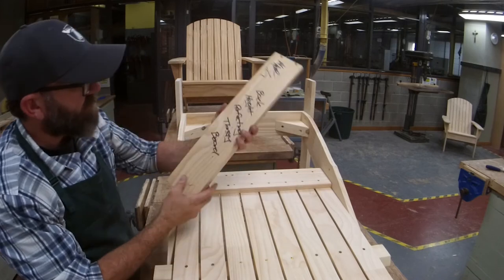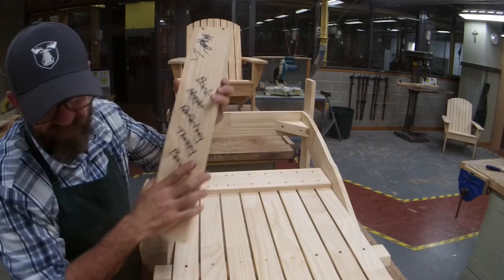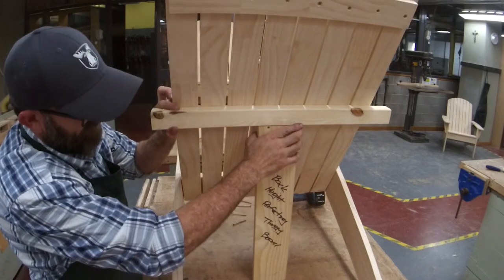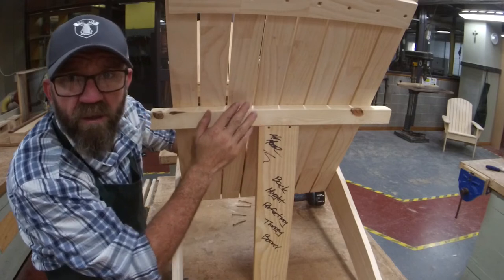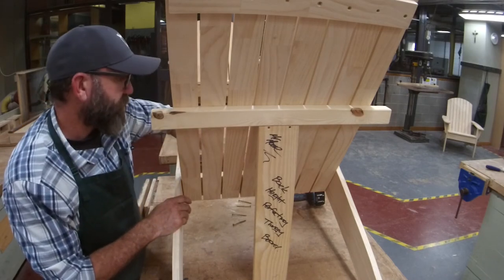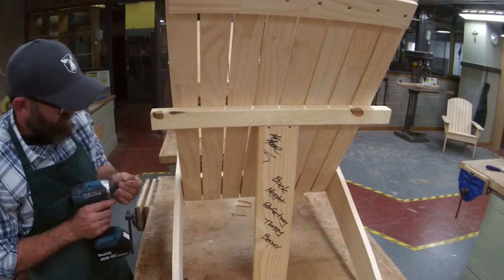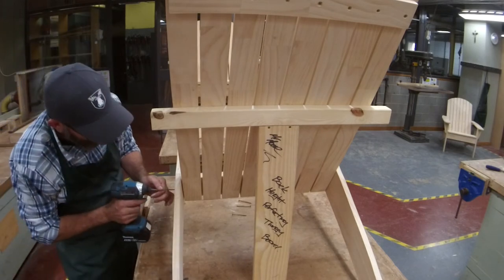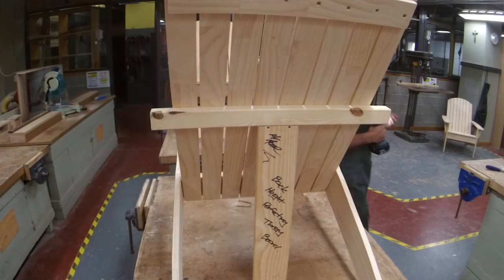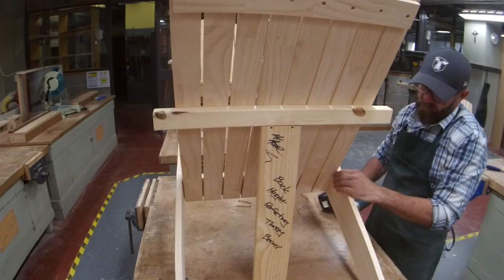For the next two holes, the next two screws, I've got this most important back height perfecting thingy board. And this is brilliant, especially if you're by yourself. I use it to prop up where the backrest should go. So now I can put the screws in, and you'll check where your pilot holes are, that they do hit that center support section that we're after. Make sure it does. I normally go one this side, one that side, so we'll finish it off. Good.